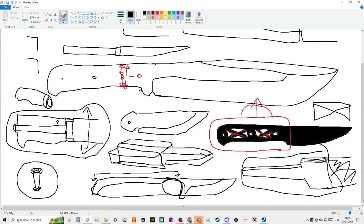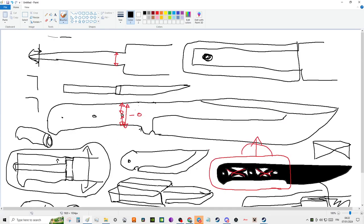So this brass here is actually your force distributor. So the tsuba, just the steel alone, is often something like this, right? The hole. But this here is filled with some kind of brass too. Sometimes it's only on one side. And that's to prevent the splitting from these corners happening outwards. And so it's possible that you could even implement that in your blade.